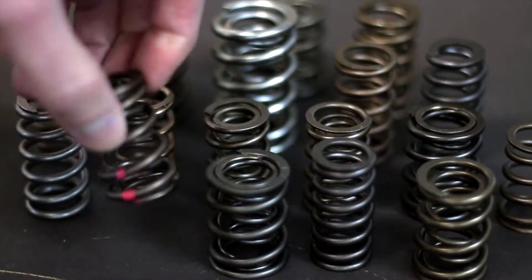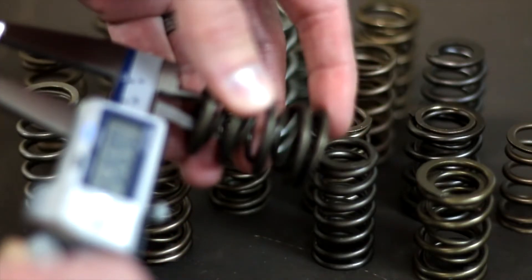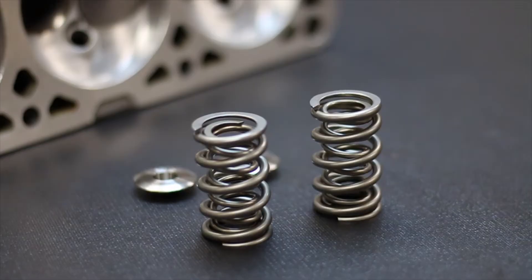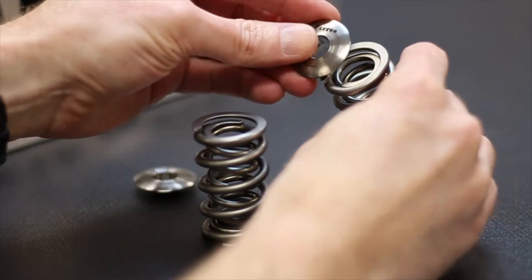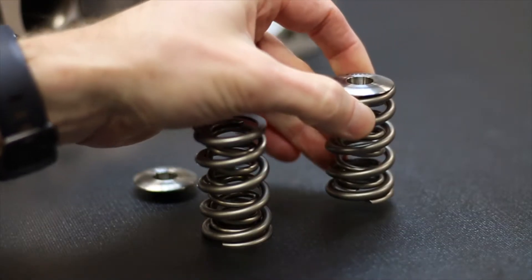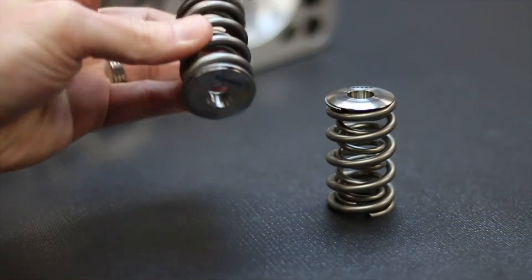When we manufacture, we always look at tolerances between valve springs. We can do a batch of valve springs and the tolerances sometimes vary — sometimes greater, sometimes less. With valve springs there's always a situation where tolerances run greater, so you want to manufacture a retainer where that fitment is what we call a press fit on the titanium. You're looking at a retainer really going into that spring and pressing it on, where there's very minimal clearance between both those areas. This allows for a lot less wear on the bottom side of that retainer when you have excessive RPM, horsepower, or a really large camshaft.